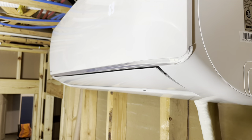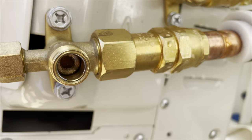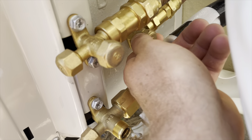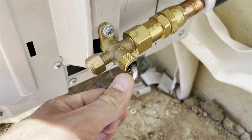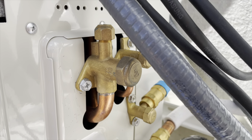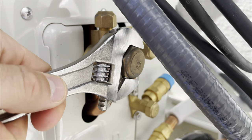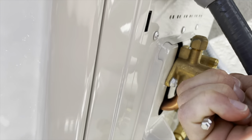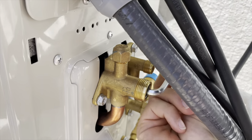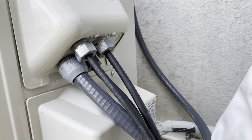Then I just had to hook up the line sets, which can be a little bit of a pain depending on how much space you have, and you've got to be really careful and make sure you don't kink any of the lines. This four-zone unit has four zones labeled as A, B, C, and D. The instructions tell you to put the air handler with the highest BTU rating on the lowest zone, which would be A, and then the next lowest on B and next on C and so forth. My biggest unit was my 18,000 BTU unit, so that needed to go on A. I unfortunately really didn't cover this part of the process very well and I apologize for that, including the electrical hookups. I'll make sure to cover this stuff better when I install my other unit.